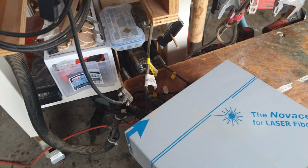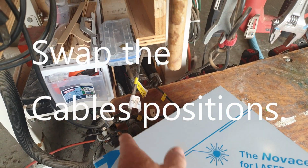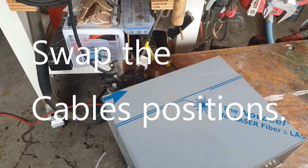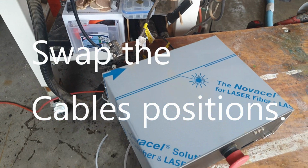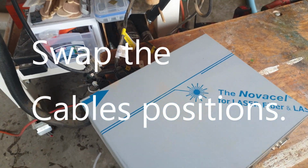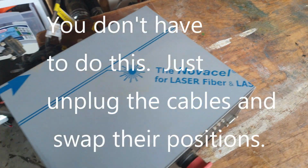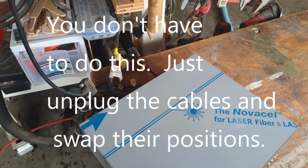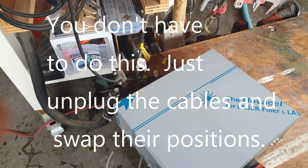Okay, a few years ago I had one of my controller cards get a little flaky. And I learned that I could just swap my controller cards and see which one of them it follows, whether it's a cable, motor, or a card. And so I'm going to swap that out. I'm going to pull the case's screws off of it, get down inside that, and then I'm going to swap the X and the Y card and see where the trouble goes.